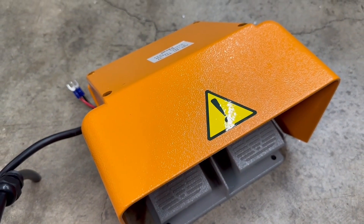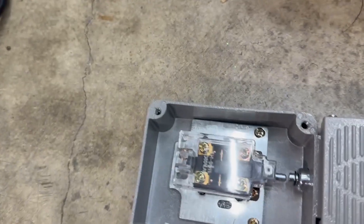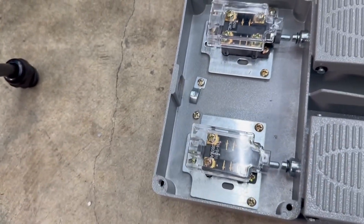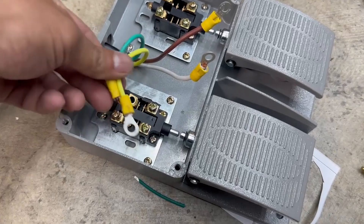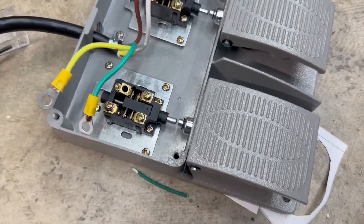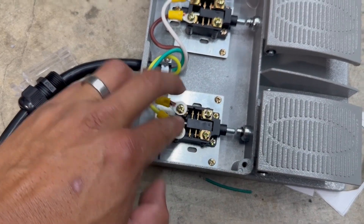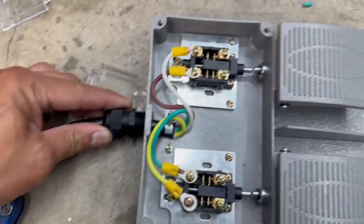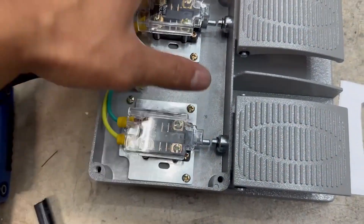I'm going to open this up and wire that up. You can see: normally open. Hit that — connects these two wires together. Same thing with this one — push that, connects these two together. So we're going to use these two here and these two here. You're going to use some ring terminals or spade terminals to connect it. These two would go together — it doesn't matter if it's left or right. This is for the kick pedal and this is for the jog. Closing the circuit essentially. Then we're going to install this piece back, put the cover back on. Probably could have used different terminals to get this cover fully seated, but they're not ever really going to touch — maybe it just keeps the dust out.